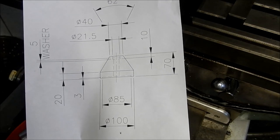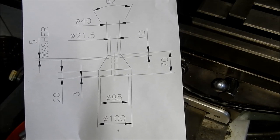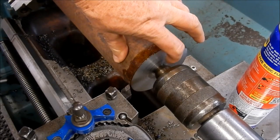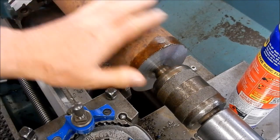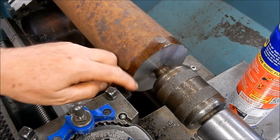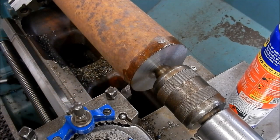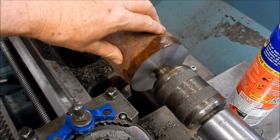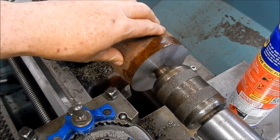Let's make a start with the stock and we'll see how things turn out. I've got a good center in there now. It was a little bit dicey machining it with the overhang, but now that I've got that supported I've got a very fine tool to get in there to do the facing off. I don't have to go all the way up to the center because there's going to be a counter-bore back to suit those jacking screws.